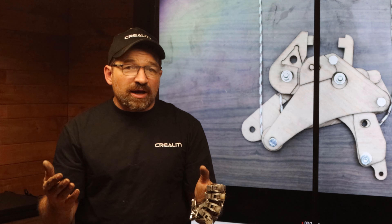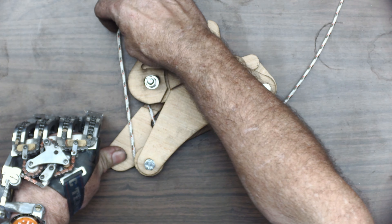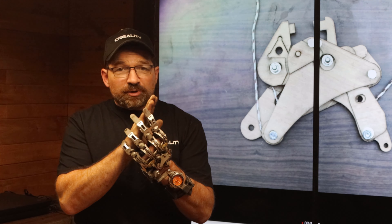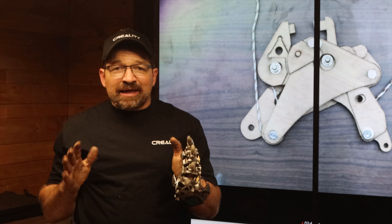Where it's a through design — say if you have force on the index and middle — then as you can see it pulls the rope through from the pinky and ring. What that does is allows you to have a super-compliant grip, so the fingers will adjust to just about any configuration.